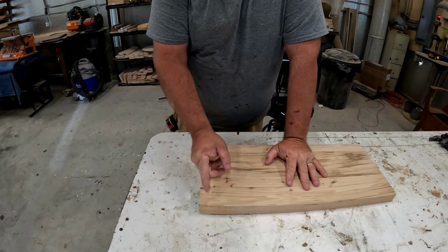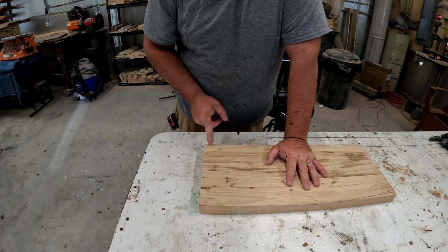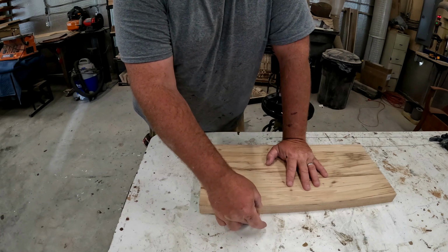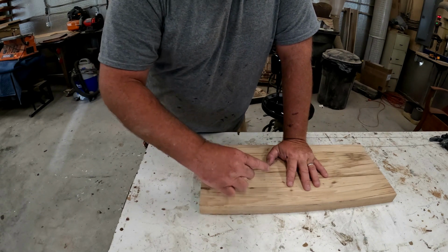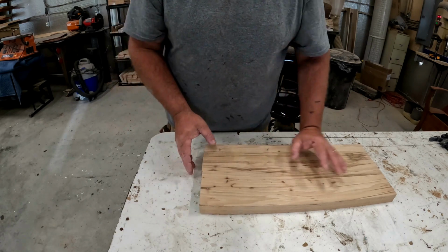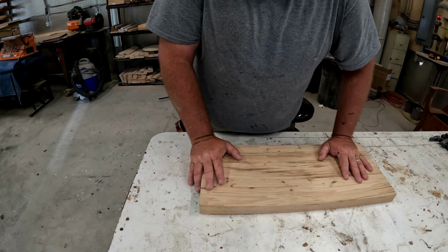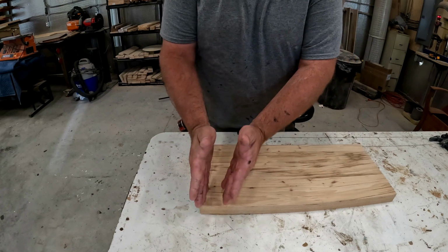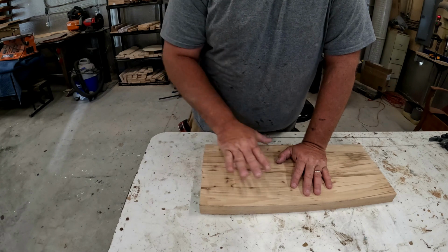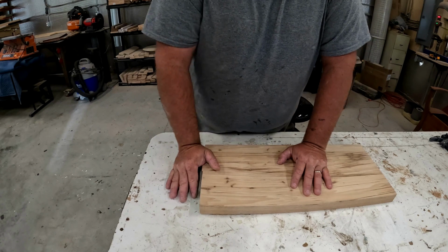I'm going to take my miter gauge, set the saw blade up high enough to get above the piece, square off an edge, and then we're going to go ahead and cut this. What you want to figure out is, based off the width of your piece, however far you end up cutting these for width, they're going to rock up 90 degrees because it's an end grain. This is a flat grain board, you could finish this right now and make it a flat grain hickory cutting board. But we're going to take it one step further, where we cut our piece off and flip it up. That'll make it an end grain, so the end grain is pointing up instead of the long grain. That's the difference between the two. So it's basically just one more step in the cutting board process.